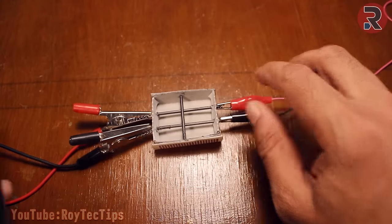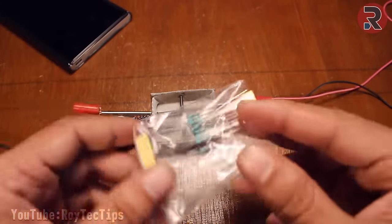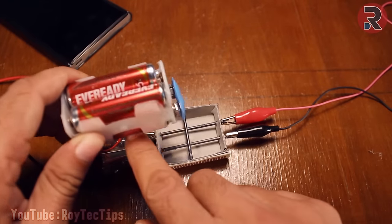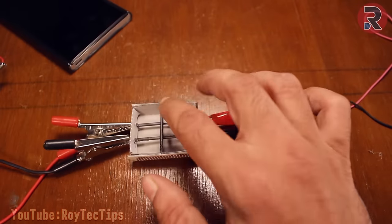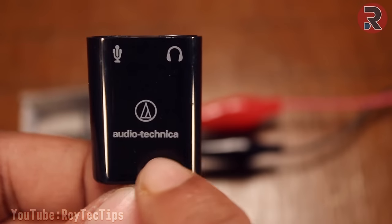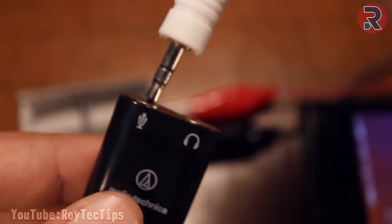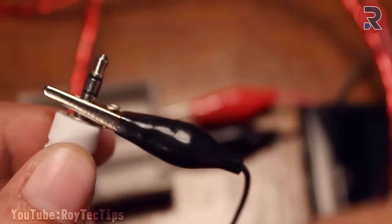Now I'm going to connect this microphone with my phone and try to record it to see what happens. You can use a resistance of maybe 1k to 100k depending on your setup. The batteries I'm using are almost dead, not much juice left, so I can connect directly with my phone. With new batteries, please don't connect it without any resistance. I'm using an adapter by Audio-Technica that divides the audio out into headphone out and microphone in.